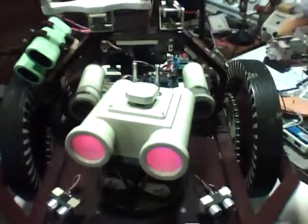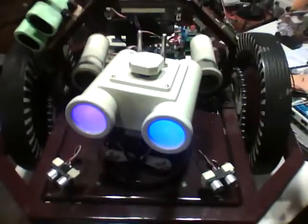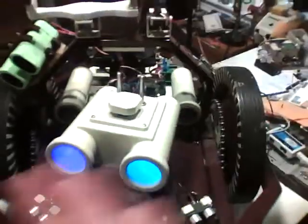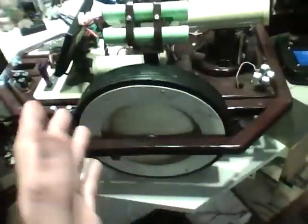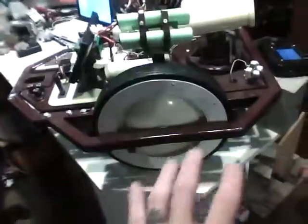So let's see what Mr. Walter can do here. The first thing I'll do, running these DeWalt drill motors, one of them has to be running in reverse because it's on the other side of the robot. So drill motors are far more efficient one direction, not the other direction, so calibrating them is important. I found that I work off of a 100 millisecond desired time, and then to change the speed that I calibrate at, it's the number of counts that have gone by, and I found that a certain number of counts equals a certain feet per second, and I've determined all that.